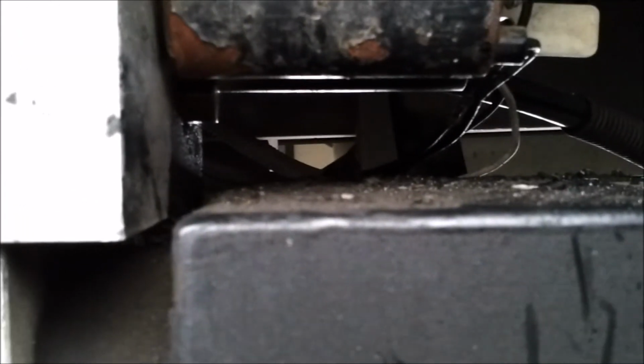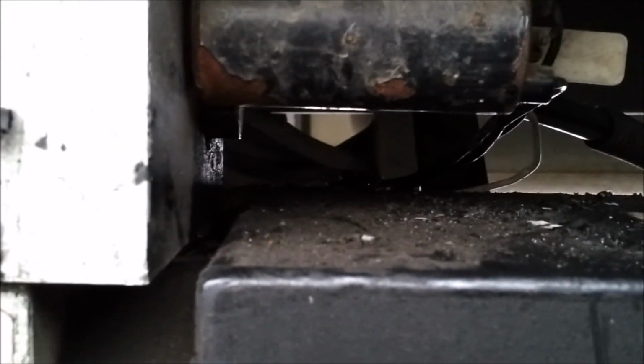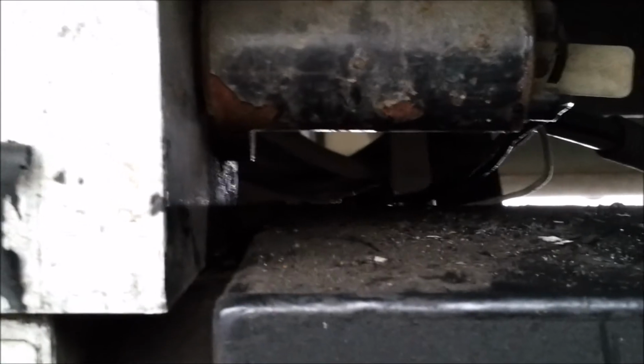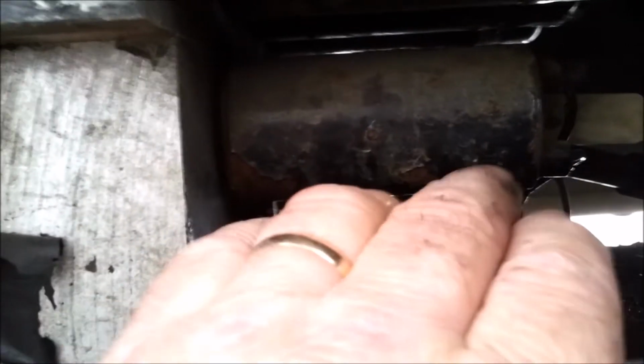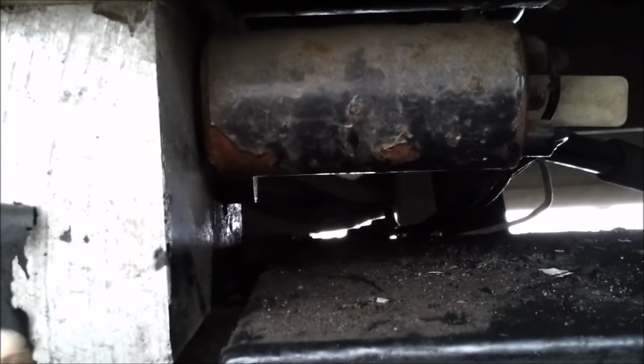And come to find out, right in between these two extend valves, and if you can see, right up against the manifold, right in between there is a 5/8 inch plug, which is actually a check valve. And when you take that off, which in this case, to get a socket on there, I had to pull that far valve back off to get it out of the way, because this check valve's touching it. It's right up against it, so you can't get a socket on there.